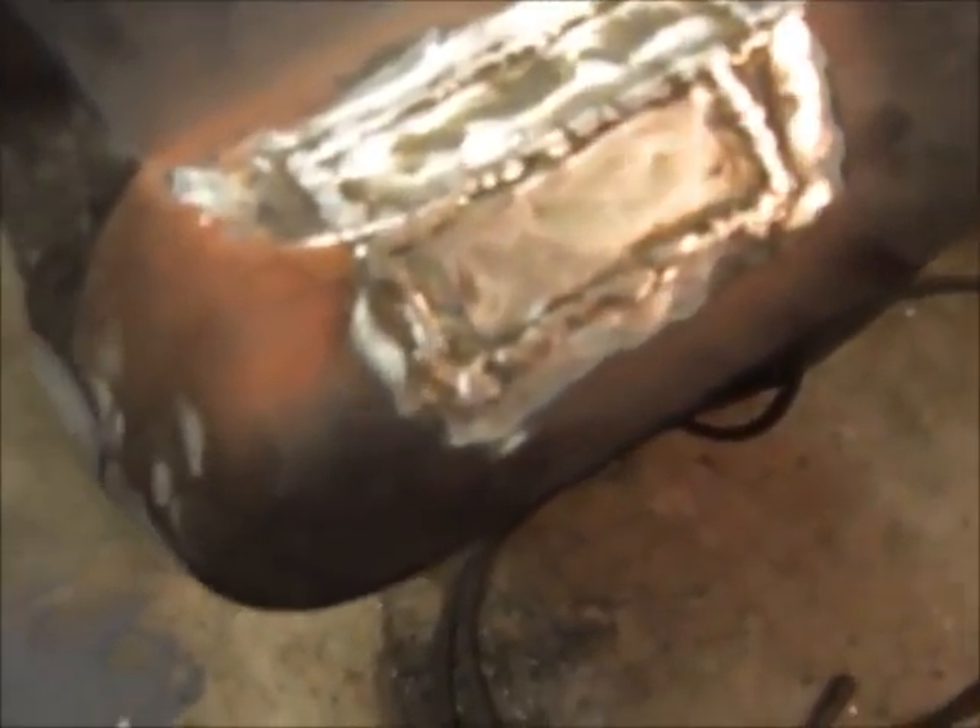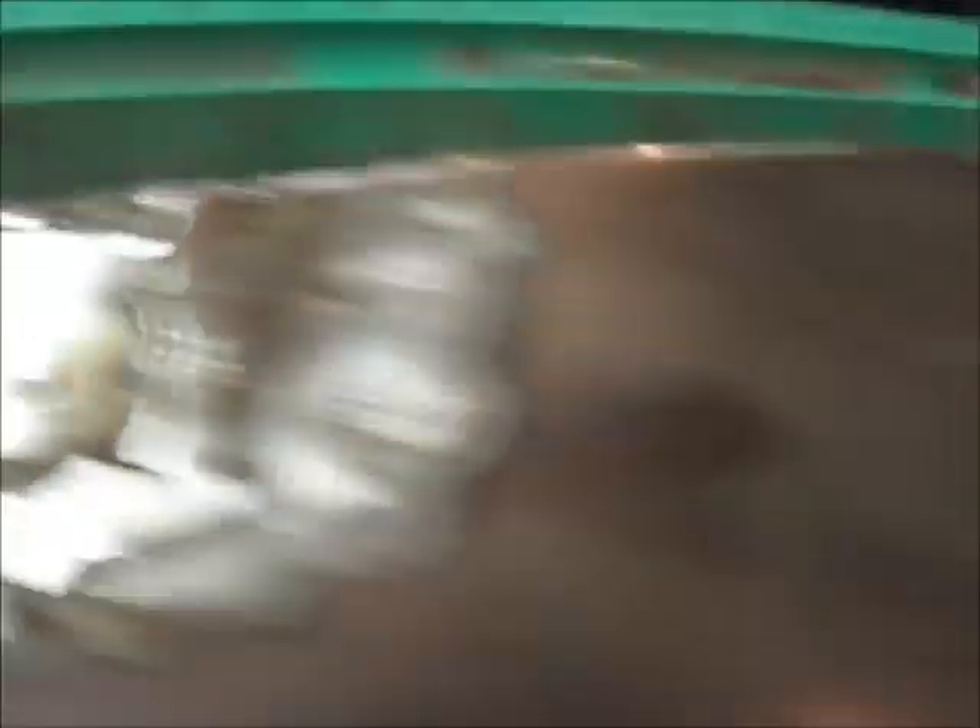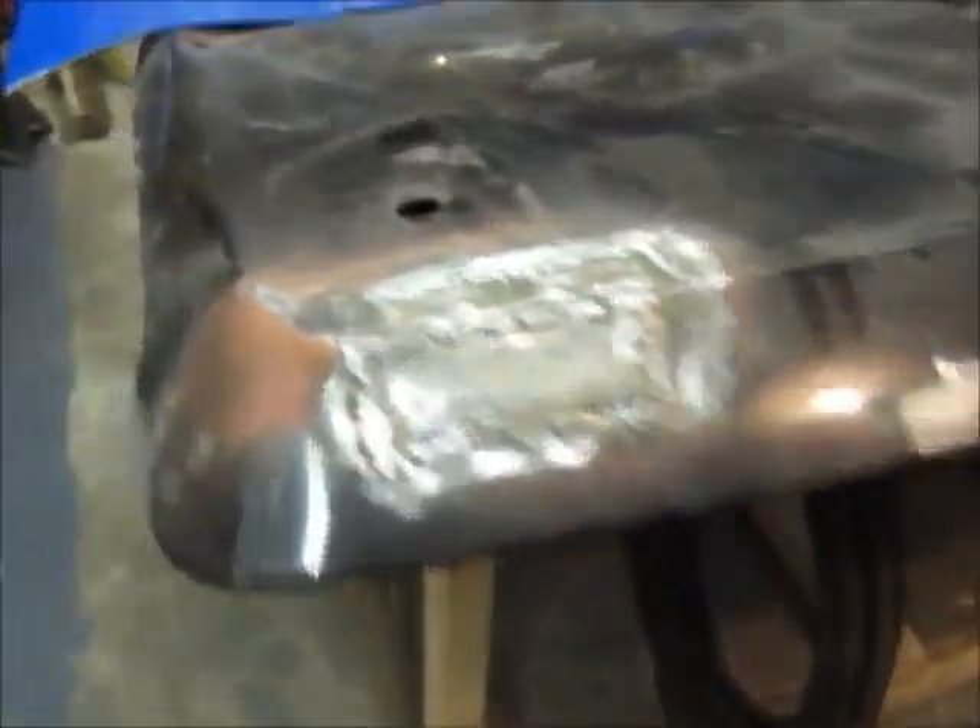In my haste doing these crappy welds I also didn't keep an eye on this line, so I've got a bit of a gap there that doesn't belong. I'm gonna take this big screwdriver - I have access right there - and try to get that tapped up a little bit. I'll do some more grinding, probably finish it off by sandblasting it all out, then maybe flip it over and flood the back with epoxy or use short strand fiberglass. I gotta work on this warp area too - it's mostly bringing this back up while tapping that down. She'll be good. Just doesn't pay to rush welding.